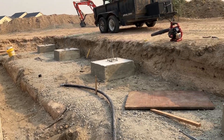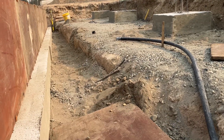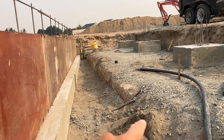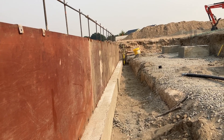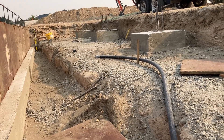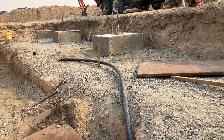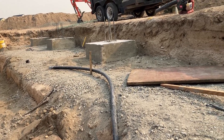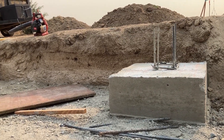We've got another porch off the back here that has shorter columns because we dug down to good solid dirt on the back, and this was outside the original basement footprint — so this side had no basement. We actually rotated this house clockwise, and when we did that we got into some good dirt over here. We just dug down enough to get below frost line, which is two feet, then poured these footings the same as the front. But the columns don't have to be nearly as tall, so the sonotube will be a little bit shorter.